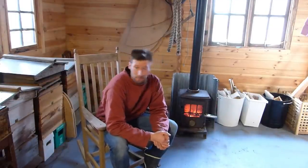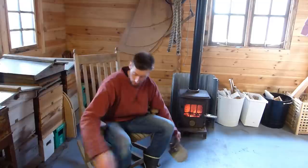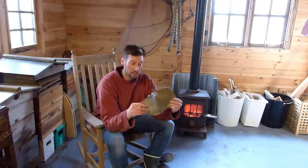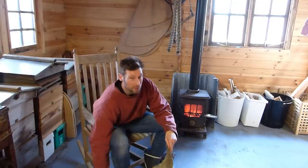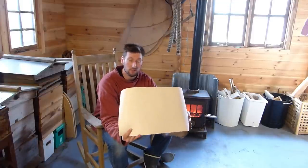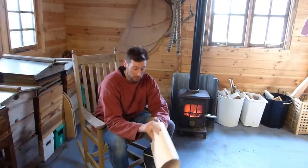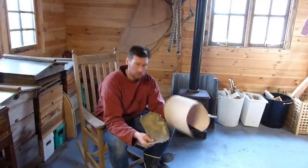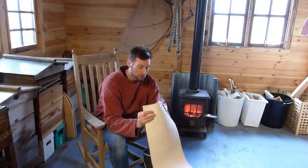Well, this next bit is really quite simple. We are about to leather up the gaff saddle, and we already have the templates that we took off from the saddle originally, so that makes it really very, very easy. We take our leather, in this case I've got some 5mm veg tan bridle leather, or saddle leather. So it's nice, heavy, strong stuff. It's going to last a long time, take a lot of abuse.